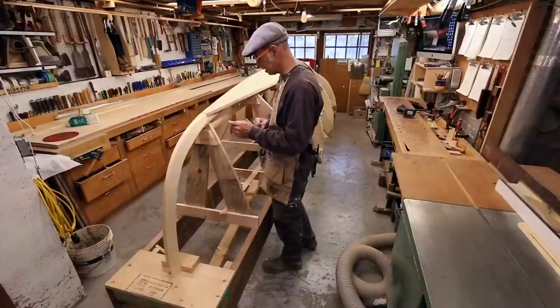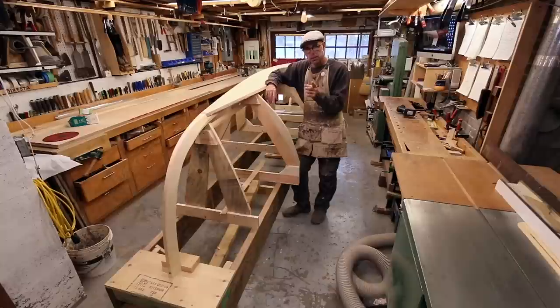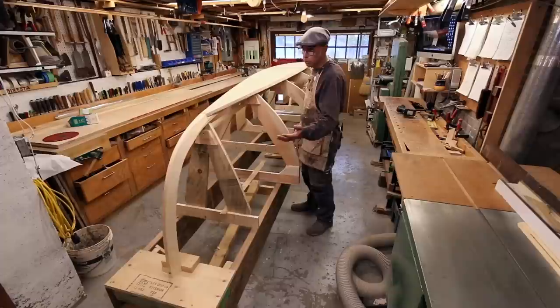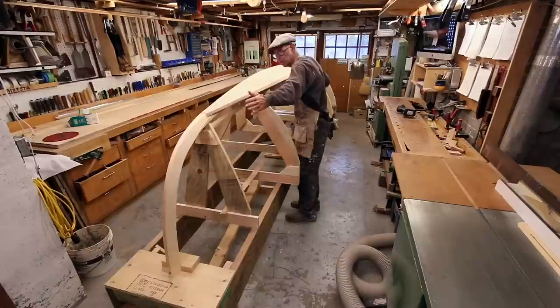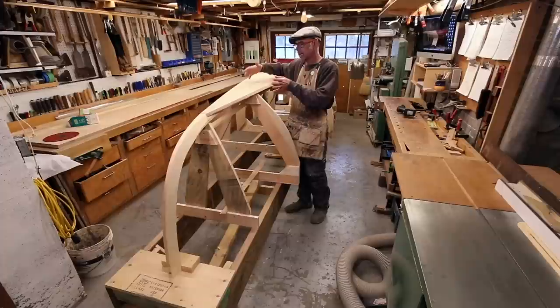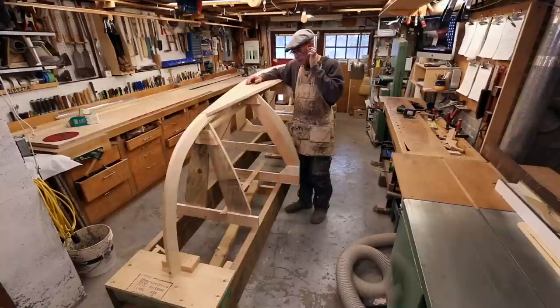So using the rib bands, the way I was taught to do it was from Tom Hill's book on building ultralight canoes or ultralight boats. It's a great book and it got me started. One of the things that he suggests doing is you scarf up your whole piece of planking stock, which is like a two by whatever the length of the boat is, in terms of like 2 feet wide. And then he puts the whole piece of plywood over the side of the boat and traces inside and out. You take that off, you stack both pieces of plywood on. One of them's marked, the other one isn't. And you just cut out both at the same time, clean up those edges on both, hang them both. I guess it worked out okay, but I always found it a bit awkward wrapping that plywood around the boat and getting it clamped in place.